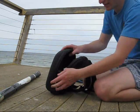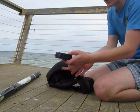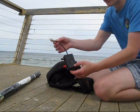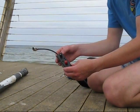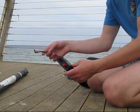In the main bag, we've got a little antenna coupling unit. It's 40 metres only, a bandpass filter. It matches end-fed half-wave antennas to 50 ohms. Another thing I like about it is it's got its own lead and PL259, so you don't need to carry a separate cable. That's one less thing to leave behind at home.